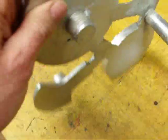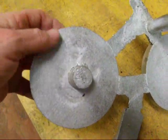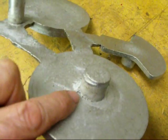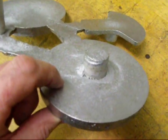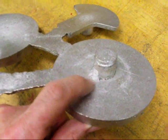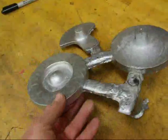I wanted some way to hold the head when I machine it, so I put a little stem on the back side at the last minute and I did not bother to put a fillet in there. Here's a good testimony as to why I should use fillets: there's a bit of a hot tear right there at the tip of my finger. Also, whenever you have sharp corners anywhere in your sand mold there's a great tendency for edges to break off — and here we had a break resulting in some extra metal. Not going to hurt a thing on this one, but that's the reason for fillets.